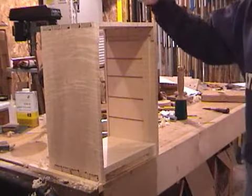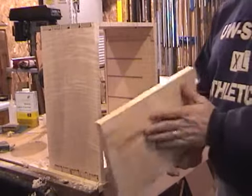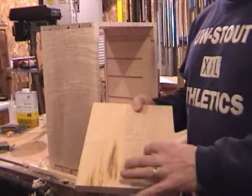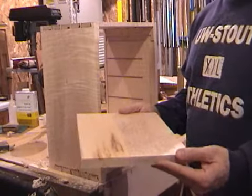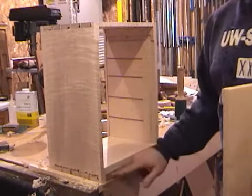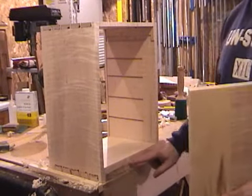At this point the basic box is glued up. I also went ahead and glued two of our false tops and false bottoms together. These are combination boards - in this case I used probably five inches of curly maple balanced with pine. Literally two or three inches is all you need; that's all that will really be exposed once the drawers are in. I've got one that is basically the bottom of this dead space tray area, and the other one goes right tight against the pine bottom. This is just basically to build height - our molding will cover up the pine and then about five-eighths of this will be exposed and revealed around the door.